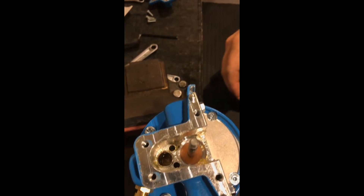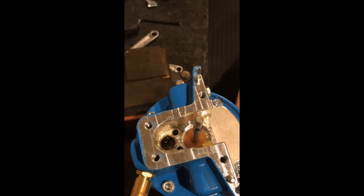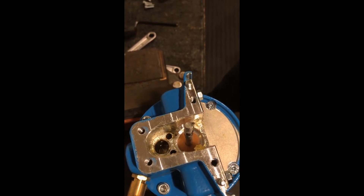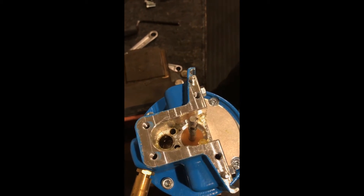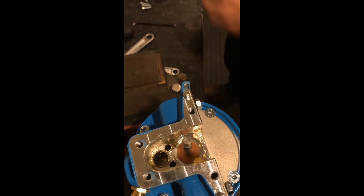Make sure the dampening gasket hasn't disintegrated. If they're not in place, your pump can over-cycle or over-position itself and stall itself out, in which case you're no longer running. So take a look at those.